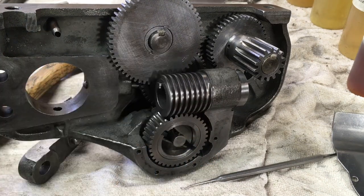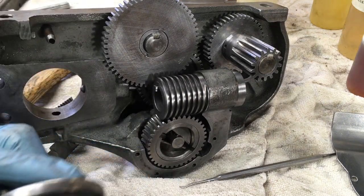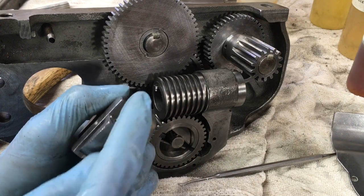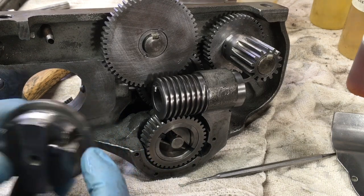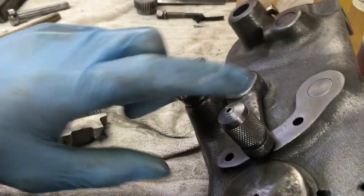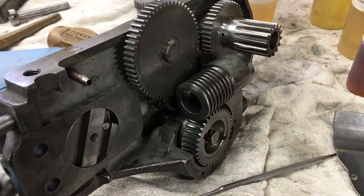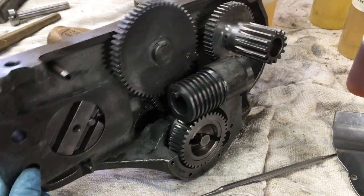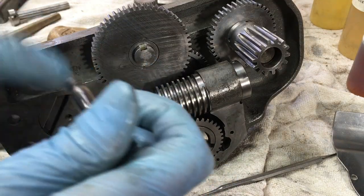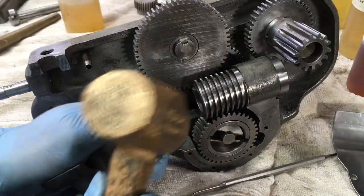Then we take our engagement lever - first apply a little Type C. Notice this milled-out slot - this slot's got to go in that pin, and then the pin seats in this V-groove. It won't engage if the lever is in neutral, because it allows this to spin. When it's in any other position, it locks - genius design. So now we've got to install our half nuts. This is the bearing surface, and notice how we have this little reservoir.